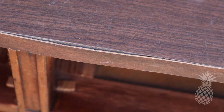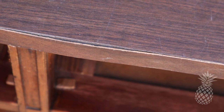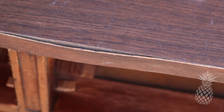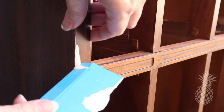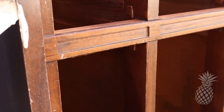With these old pieces, sometimes the veneer edging tape comes loose. When that happens, it's very easy to retouch it by heating it back up with an iron, which usually reactivates the glue. In this case, it wasn't really working — we left it on there pretty long, it got hot, but it didn't completely reattach. It got really hot; I burned my thumb when I checked it. So we had to find another way.